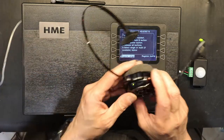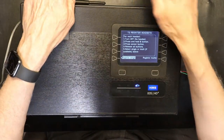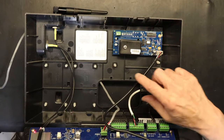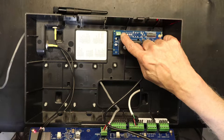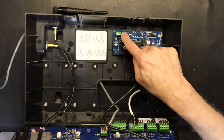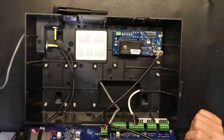Let me turn this off and show you the loop vehicle detection setup. This is the normal type of connection — these two pins go under the concrete with the coil, come back, and keep the connection running as long as the vehicle is present. So I hope you've learned how to install this motion sensor. For convenience and price it's great — quick installation, and you'll hear the beep in your earpiece when a vehicle comes. But for professional reliability, you'll need to spend thousands cutting the concrete for a loop. Thank you for watching — please like and subscribe.